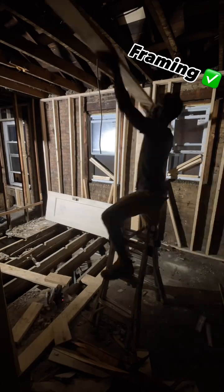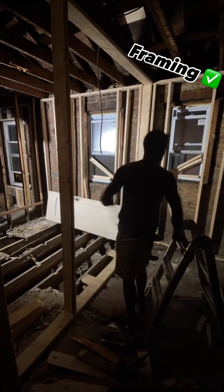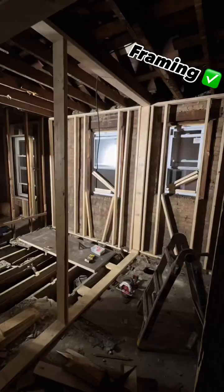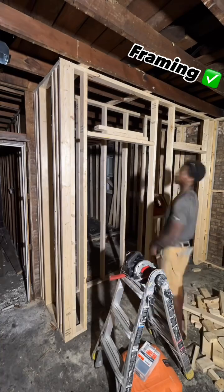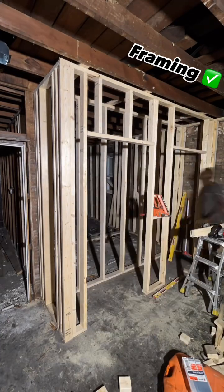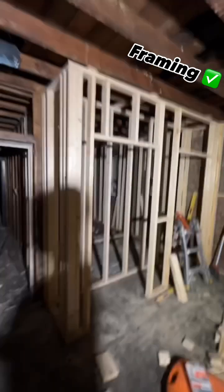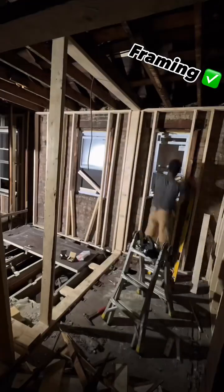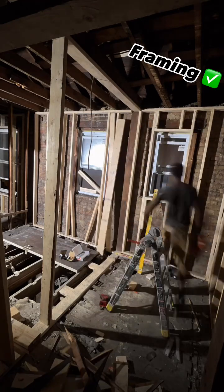This is a Jack and Jill bathroom, so a six-inch wet wall. Get something to nail to — two on the bottom there with a joist. Back into the closet to finish up a few studs and cripples.